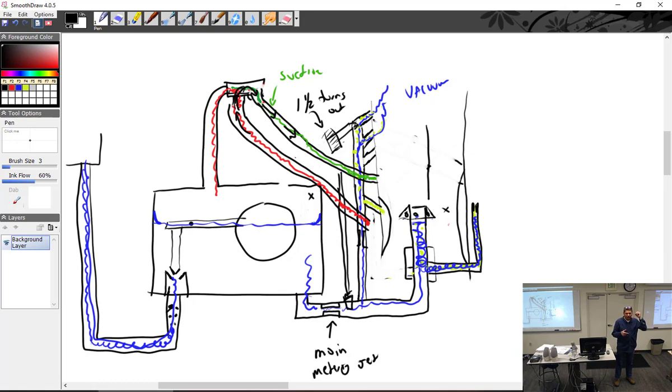I'm going to confuse some people, I know it. Because there really isn't a throttle on the ground power unit, you're literally holding this right here and making it go. You have to use the screw. But it's right there. You don't have to stop it or anything. You just kind of move it in and out where you want it. So on that, you really are going to just set the throttle kind of where you want it. It just makes it easier. And if you want it to go a little faster, screw it in. You want it a little slower, screw it out. It's just right there. It's just what you have to do.